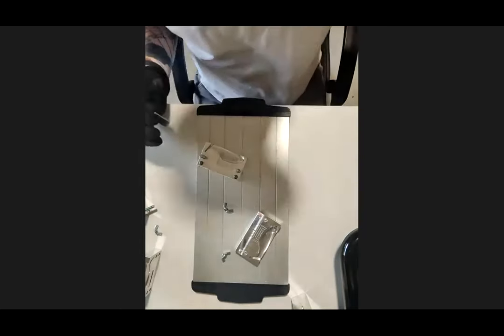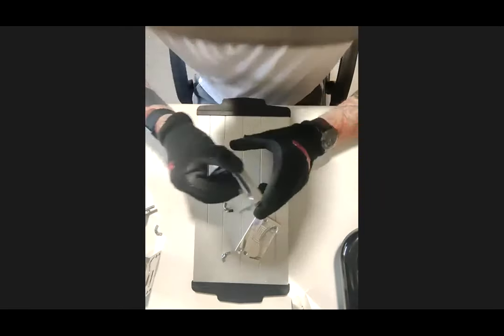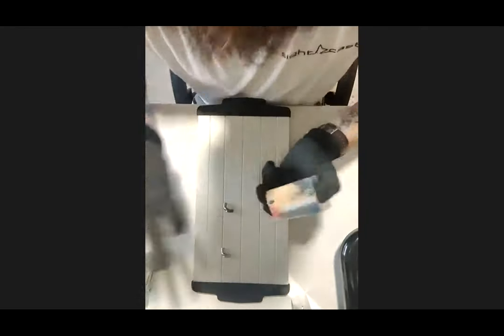Are air bubbles cosmetic or integrity of material issues? It is a material issue. I use Dead On plastic because it's probably the best plastic there is on the market. It is low bubbles. It comes that way. Like I had mentioned in the beginning, I introduced a lot of bubbles because I was overly aggressive in shaking the container, so I was causing myself headaches. I went and bought the vacuum chamber, and that got rid of most of them.